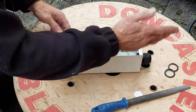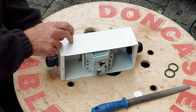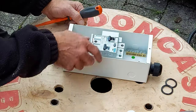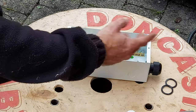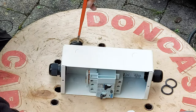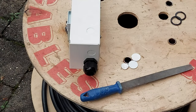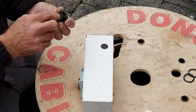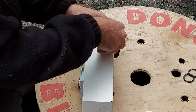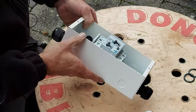So now, I'm going to address this with my tails. I can bring the EV up through there. What I also do here now is take this one out for my CT clamp. Cut the EV Ultra too long, strip the 6mm back for here, and then bring the data cable out here. So I use these little whisker membrane glands, 20mm, just clip in. It can be a bit tight, the cable through there, but I'll just make a hole first. And then that just pushes in. There we go.